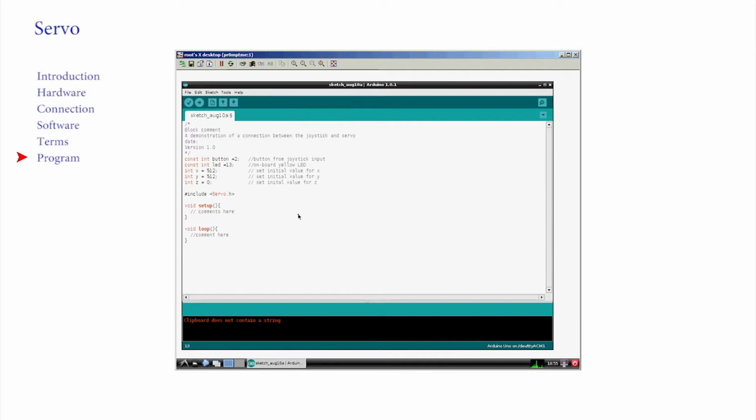Try compiling a copy without this line. The servo is known as an object, and in case we're going to use more than one servo in the future, let's make what is known as an instance of the first servo, and call it something helpful. Servo, first_servo. So we need to tell the Uno where the servo is, and this is done in the setup. Thus, first_servo.attach. Obviously, if we have more servos, we could put these in the setup too.